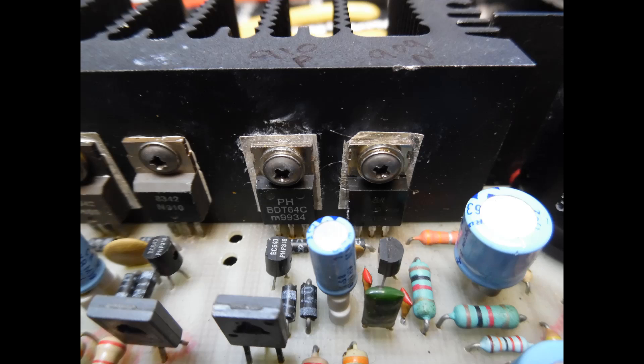Zooming in on the input circuit, you can see the five-pin DIN sockets at the rear and one of the plastic pillars mentioned earlier. The phono socket uses an integrated circuit for the phono stage. You can also see all the input selection switches. As a matter of course, it's important to clean those switches — spray DeOxit D5 into the small access hole, operate the switches multiple times, and they'll be noise-free. The power supply, protection fuses, and user controls — balance, bass and treble — are visible, with a wire link forming a common ground connection.